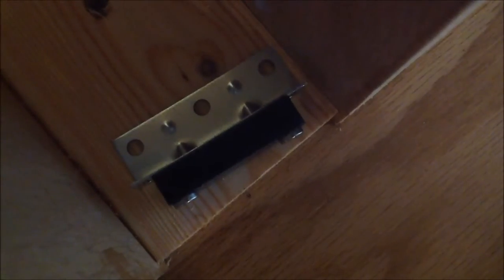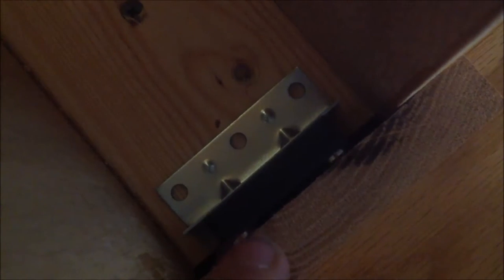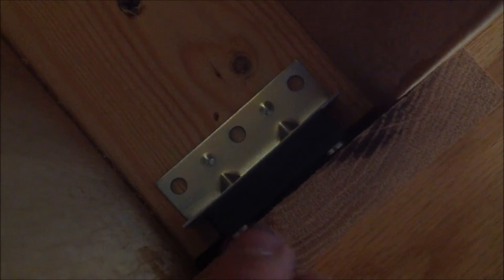Here's a close up of what I'm trying to accomplish. I have a piece of wood that is the same width as the fronts that are going to be on. I put this up tight against the front where the face is going to set, and I slide this up tight to the back of it. I center this and slide it up tight to the back so I know where to mount this in here — so there's just the right amount of space so these rare earth magnets, which will be attached to the oak front, get the maximum amount of pull to this bar magnet right in here.